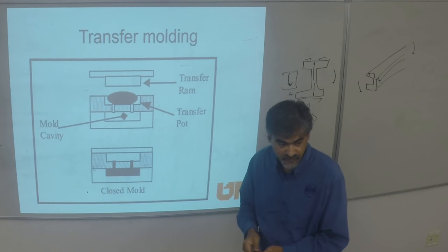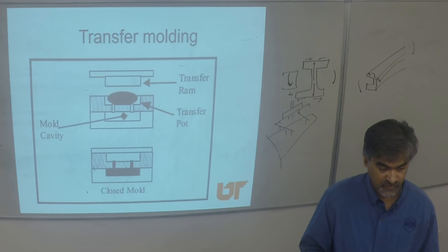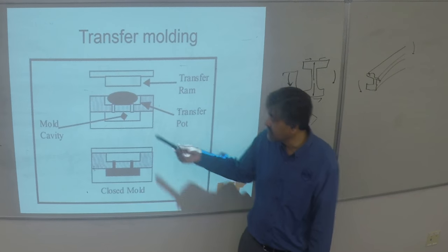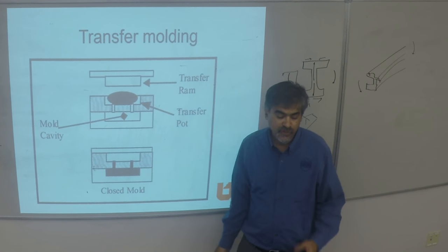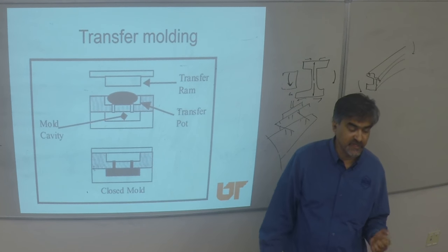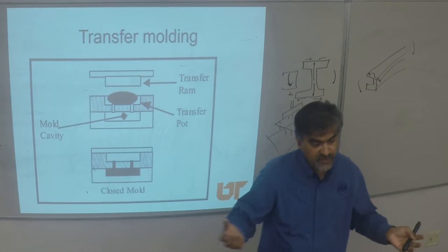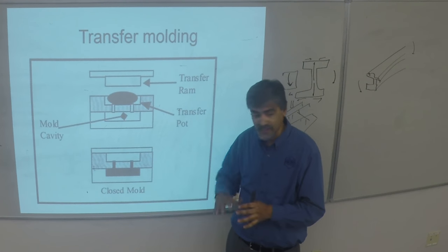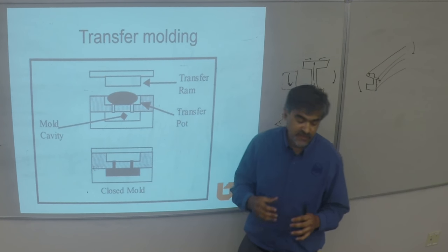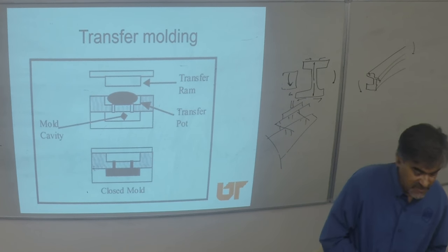Heating may or may not be necessary. You can have plastic in solid form that you process, though that's more like thermoforming where the sheet never fully melts — it just tackifies and is drawn into shape. That works for moderately shallow parts, but when you have tight radii and complex parts, molten material or less viscous material works better.